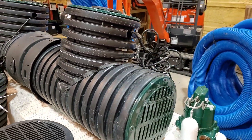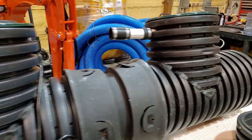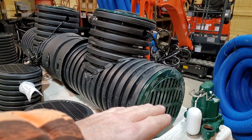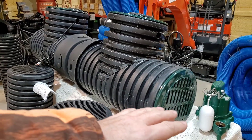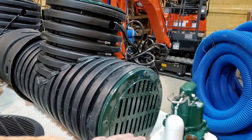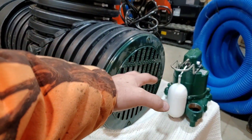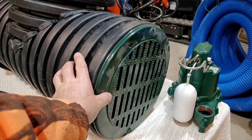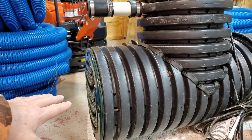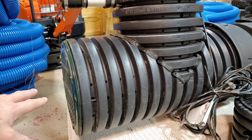Probably 50 percent of the yards we install, we do our 14 by 14, and for quad packs we do a 16 by 16. If you don't have a real swampy yard and it's just bad for a few months out of the year, you only need to dig 11 to 12 inches. That means the sump unit can be a full foot deeper than your trench, and the water will fall into the sump pit.